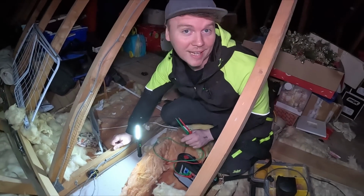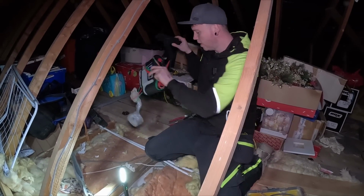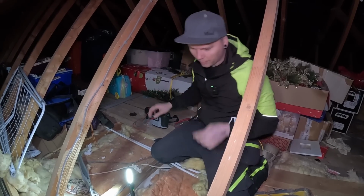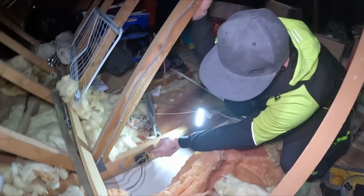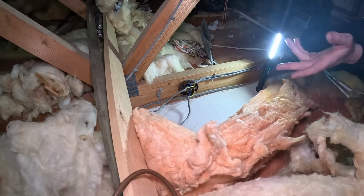Right. We're dead, okay? For all those people out there, oh, you never test, you never lock it off. We do. We just don't feel like we need to show everyone. Anyway, we're going to mark out. We know that's our load. We know that's our switch. The other two are ins and outs.